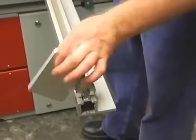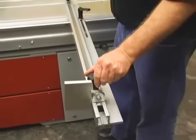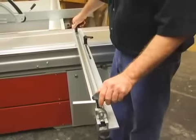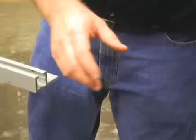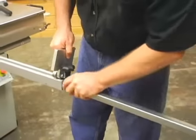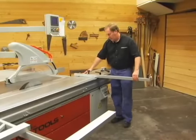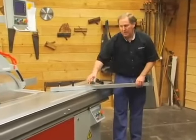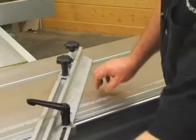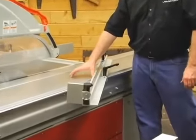The miter crosscut fence has a flip stop right here — a nice piece of heavy aluminum with lock handles on both sides. It's adjustable: it slides in and out, locks in position, and can also be telescoped out. For narrower panels, it simply slides out, flips around, and reinserts. To make angled cuts, you loosen the lock handle and the inside handle and bring it back. It goes from 90 degrees all the way to 45 degrees backwards. It also goes to the front side — not only to 45 degrees, it keeps going and you can go all the way to 30 degrees in the forward position for some really tight angled cuts.